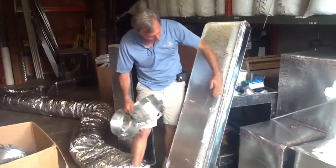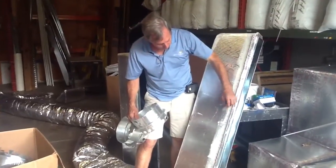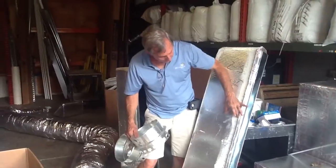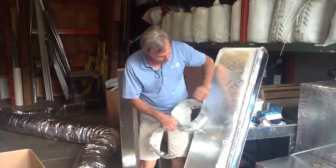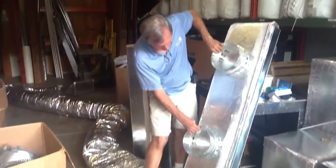Keep in mind when you actually mount your linear diffuser, you've got a joist — and usually it's going to be a 6-inch joist, sometimes it could be an 8. So you may have to make your box taller. In that case, you'd put your collars in here if it would work.